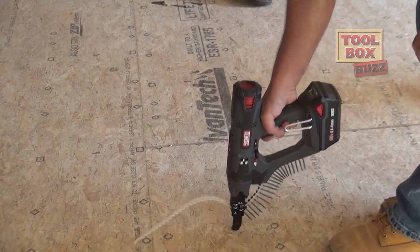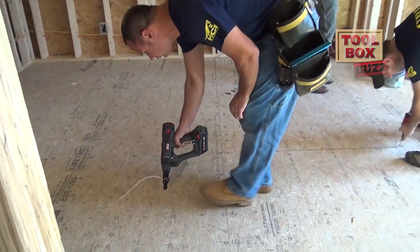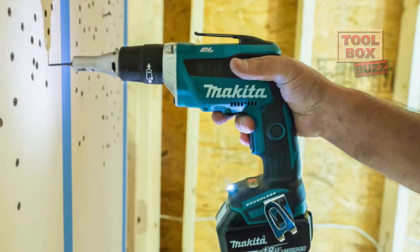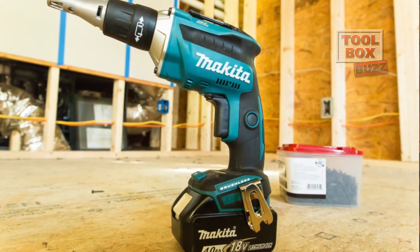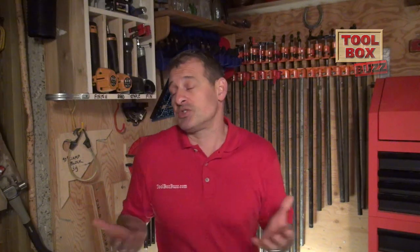The Senco tool may be too fast for its own good — we did experience some jams during testing. On noise, the average corded screw gun is well over 110 decibels, while these cordless tools were around 90 decibels. The clear winner was DeWalt, which ran a few decibels lower than the competition — any noise reduction is a good thing for protecting hearing. A strong case can also be made for Makita, which features push-drive technology — a lock-on mode where the motor only starts when you engage the fastener, limiting exposure to motor noise and reducing the duration of loud sound.